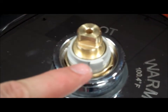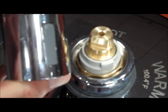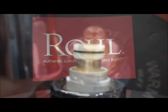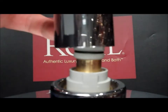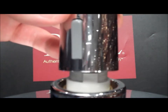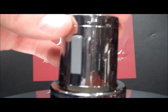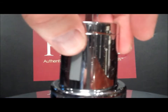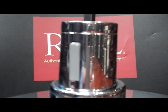The cam located on the cartridge needs to be lined up with the gray hot limit stop shown here. The best way to ensure that the dome is put on correctly is to line up the gray hot limit stop just to the left of the cam located on the cartridge and slide down into place. You shouldn't be able to turn it counterclockwise without depressing the hot limit stop, which will give you the extra temperature you need, but this location will be the 100.4 degrees that you set it at when you calibrated the valve.